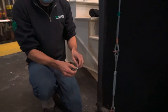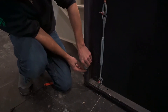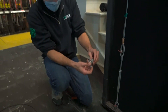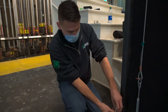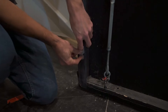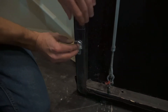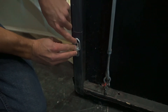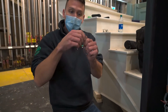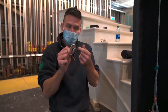This is another common piece — a D-ring and D-ring plate. You can see we welded it here. D-ring plates can also be used on the bottom of the frame. When working with wood, they need to be through-bolted. The issue is that they push flat up against the surface, so you don't really get the clearance to fit a nice piece of hardware in there — maybe a quick link at most. These are actually not rated for overhead lifting, with the exception of a very few manufacturers, so for the most part we don't use D-ring plates for overhead lifting.